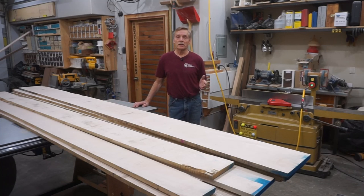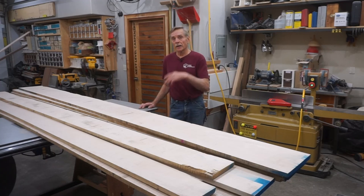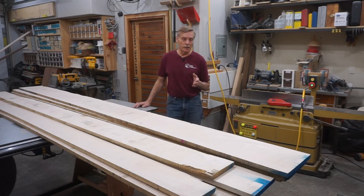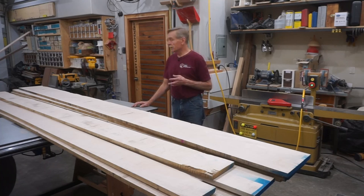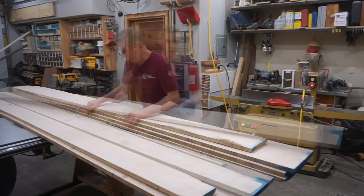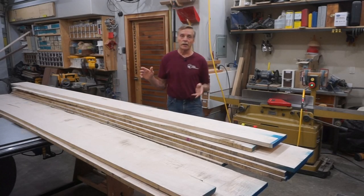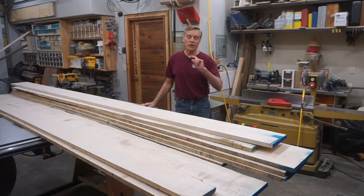As I start that, I'll explain that there's a ton of nickel gap options out there on the market ranging from really bad to mediocre to actually pretty decent. It's available in various materials — pine, MDF, etc. But in working with my client and her designer, we decided to take this little job in a different direction because none of the standard profiles in the standard materials were going to be acceptable. To achieve the ultimate design we decided on, I'm starting with this soft maple material — random width, hit and miss. It's in fairly rough shape, but out of this stack I need to get 26 pieces that are five and a quarter inches wide, a little over five feet long, and they'll end up at five eighths of an inch thick.